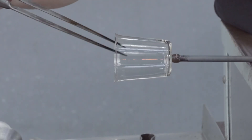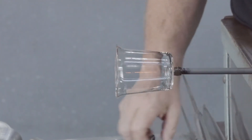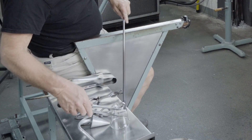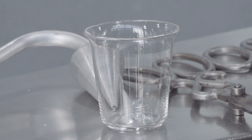The shape is refined with a little bit of shaping on the inside to create the rim flare. A little tap on the metal rod — the punty — breaks it free. The vessel can then be placed into the annealing oven for slow cooling.